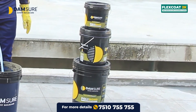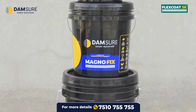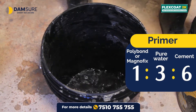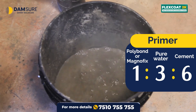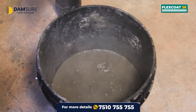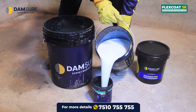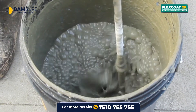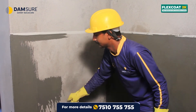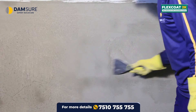Damsure Polybond can be used as a primer when using fiber mat, and Magnifix when using a recron mat. To prepare the primer, take Damsure Polybond or Magnifix, pure water, and cement in a ratio of 1 to 3 to 6. The quality of cement used should be ensured. First, add 3 liters of water and 6 cups of cement and mix well. The amount of cement can be increased or decreased as required. Add 1 liter of Polybond liquid to this mixture and mix well again for 3 minutes. Apply the resulting primer mixture on the waterproofing surface with a brush. Its drying time is up to an hour when the ambient temperature is normal. When the primer coat is completely dry, scrub the surface and clean again.